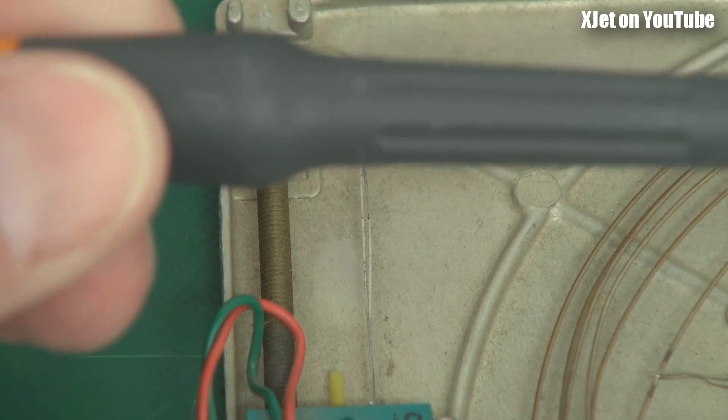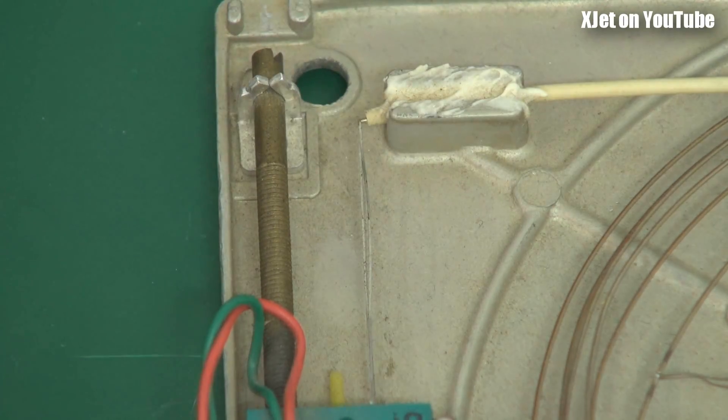When they apply electromagnetism to the nickel strips, which run right through into this mounting plate, it causes one to grow longer and one to grow shorter because of the different flux, which puts a twist in the wire. If you can imagine the wire is twisted like this, and in twisting it creates a kind of ripple that runs across the wire.